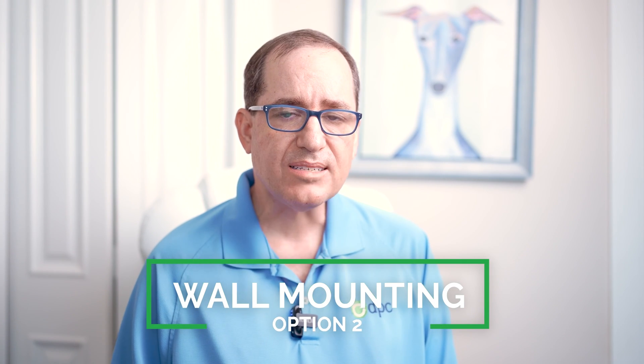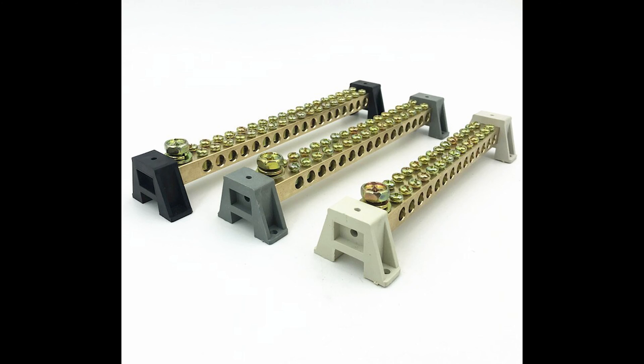The second method is for the device at the building or in the server room. You wall mount the unit and take a grounding cable — I've got a 16-gauge ground wire here that I've made as a sample. You mount it with a number six machine screw to the device. One shortcoming is that although they include the machine screw for pole mounting, they do not include the number six screw and nut needed to properly ground this method. I went to Home Depot to grab that, and I'll put a link to the proper hardware in the description.